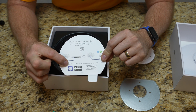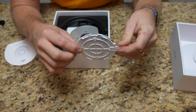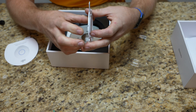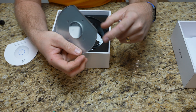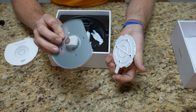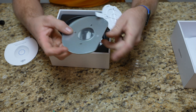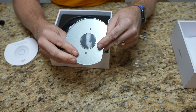I looked it up — this is the mounting plate, which is what the access point actually attaches to. This is what you actually mount. So if you're wall mounting, you can put the plate directly on it. This is actually a ceiling mount plate. If you had a ceiling tile, this would sit on the top side of the tile, this would sandwich on the bottom, and you'd sandwich the two together. This gives rigidity so you're not just pulling screws right out — it's a plate for ceiling mounting use.